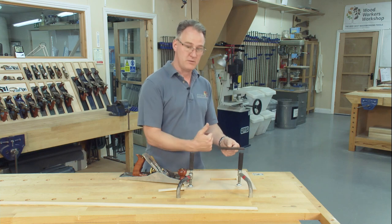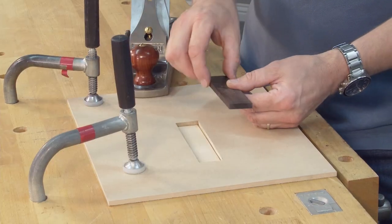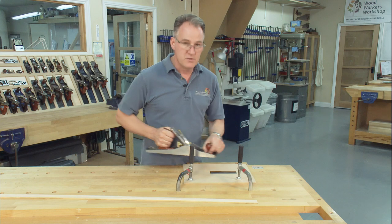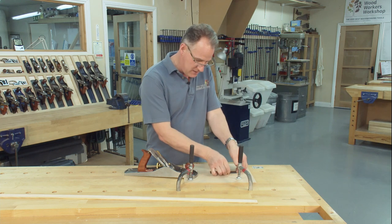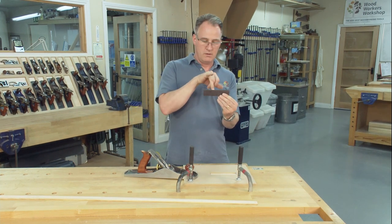Once I've got that face side finished, I would flip it over end for end, which means the grain direction will be correct. I would put a bit of veneer in there which will lift it up by half a millimeter, so I just have a skim to take off this second face. Once we're happy that we've got good flat consistent-thickness timber, I now need to work on doing the edge.